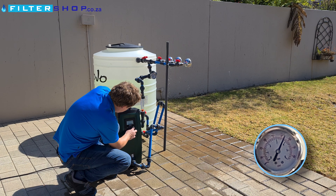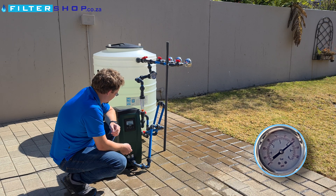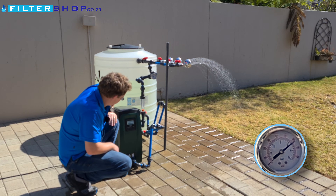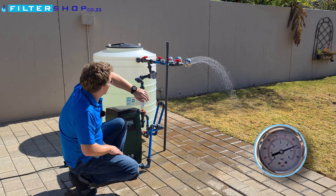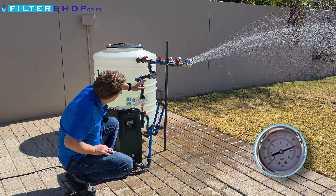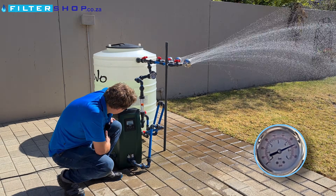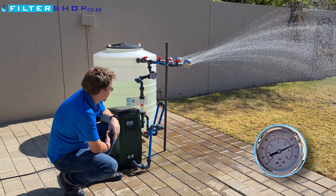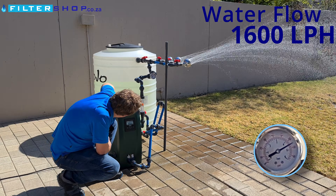Now I want to set it to 4.5 bar. At 4.5 bar the EasyBox Mini was immediately giving over-power consumption problems so we couldn't really get a single shower running even at that pressure. With a small flow we're drawing 570 watts — no longer very efficient but it can keep the pressure easily. A single shower is at 670 watts at 4.5 bar, keeping the pressure fairly well at about 800 liters per hour. A second shower we're at 820 watts for 1600 liters per hour — even at just the partial load the EasyBox Mini was sitting at over 800 watts at this pressure.